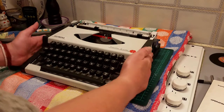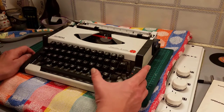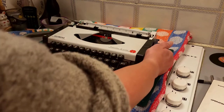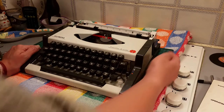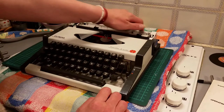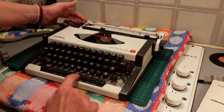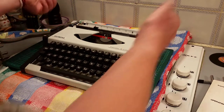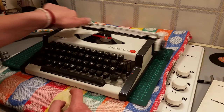So when you take the cover off, the first thing to do is lift up the carriage return. Now, you will notice it's dead. A lot of machines have a little release lever down on the right hand side or the left hand side or somewhere around here. Not there, that's a little pop-up bit. Here is the pattern release lever. So with it forward, you can quickly center the machine, put the handle down, cover on, and off you go. And that goes back there, and that is now free to move.